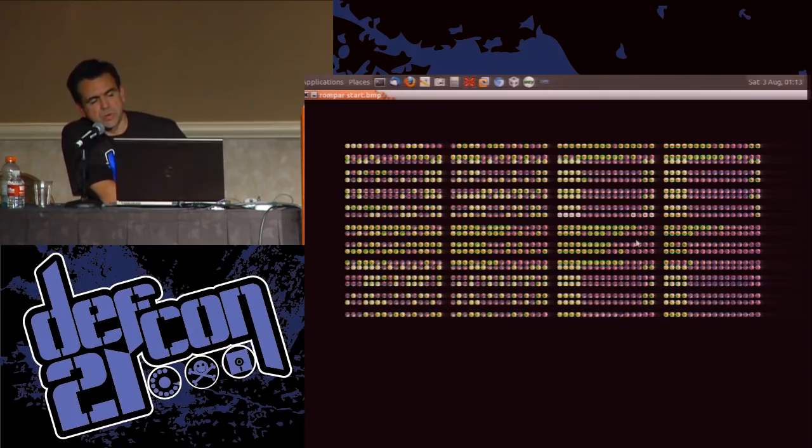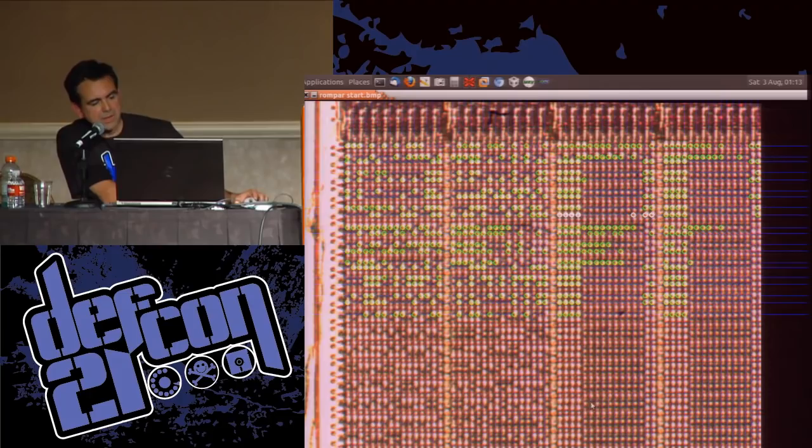We also want to try and make sense of the data. So in this particular case, we knew that an unused piece of ROM has a hex value of C1. So if I come out of peephole mode and we look back at the original image, there are these big chunks of unused data here. Okay, so here is obviously program, and here is nothing. And this repeating pattern, therefore, we would say must be C1s. So what we should see here, because it's 16 bits, I'm hoping is C1, C1. Now, the quick amongst you will have noticed I ain't going to get that.